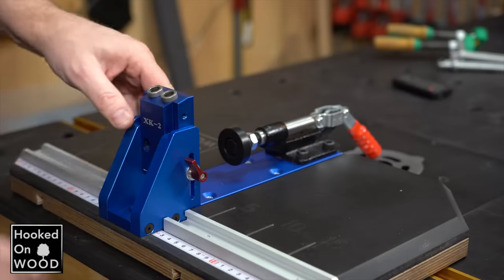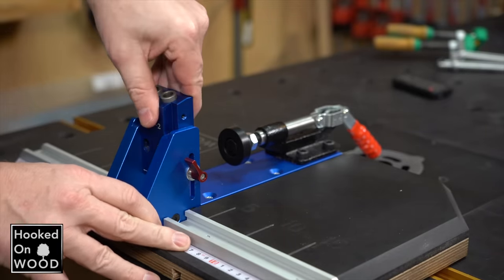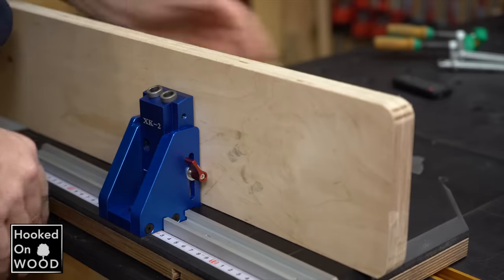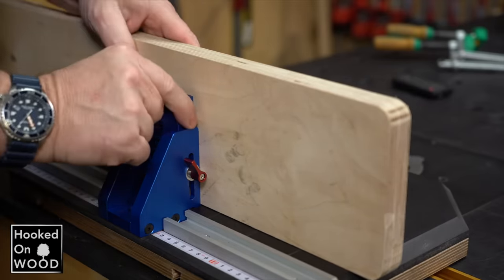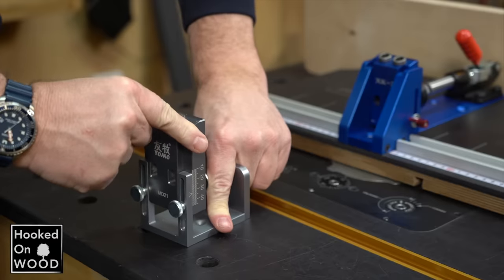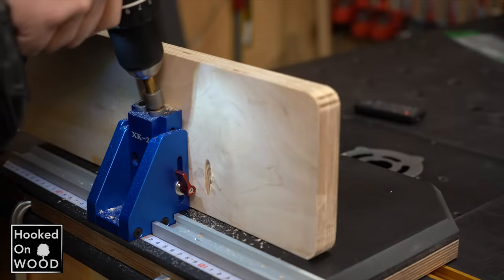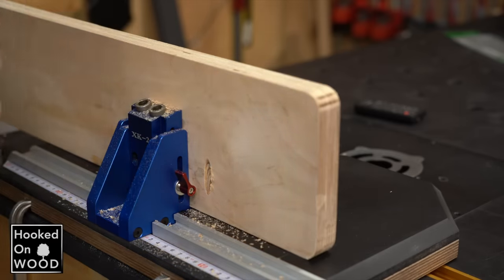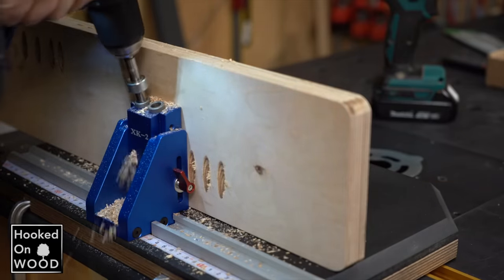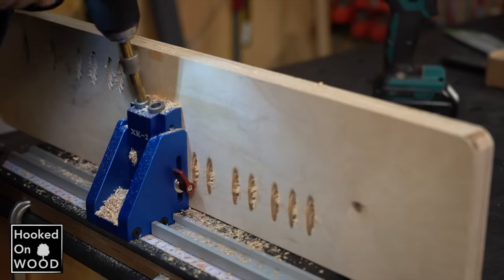There are a few other points that could be better. One is the middle piece — when you tighten it, it stays in place, but it is a bit unstable when you push it to the front. This is not a problem in practice because when you clamp a piece of wood it cannot go in that direction, so it remains stable. But other pocket hole jigs like the Yomo are more stable on their own. Another thing is the drill bit. Although it is nicely straight and feels really sharp when you touch it, it does not drill as easily as other drill bits I have. It also seems less capable of removing chips when you drill. That is a shame, because I would definitely rate it higher with a better drill bit.